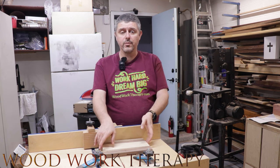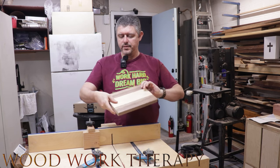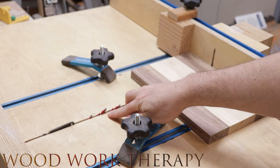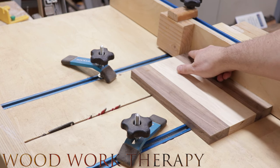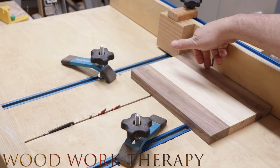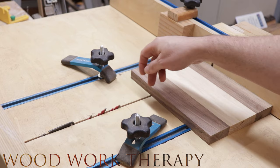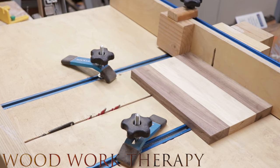We got the board drilled out. Now we're going to take the board — hole side up — put it next to our stop block. The blade is set to three-eighths of an inch, presentation side face down, and the stop block is set three inches from the blade. That gives us a perfect three-inch cut. This assumes a three-quarters inch board, so we don't cut all the way through — just deep enough to get the slicer wire into the groove.